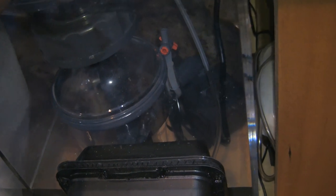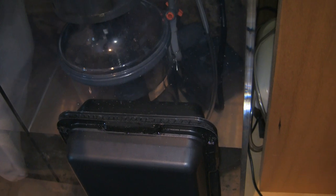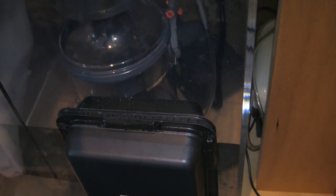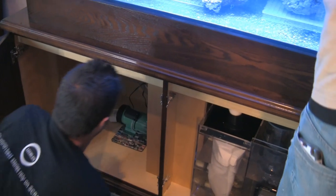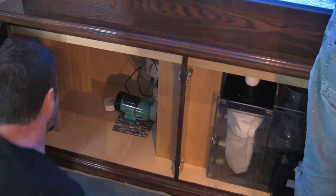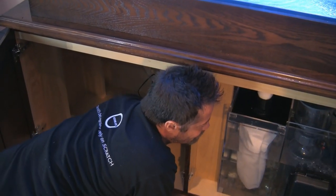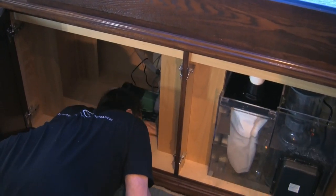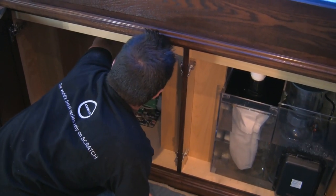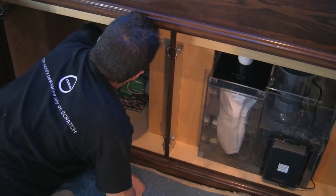Yeah. So, how far up is the water in the skimmer? Oh, it's catching up. There it goes. Your skimmer's not going anywhere now. Shut the water off. Shut the water off. Not primed yet. Unplug it and plug it back in. Oh, that elbow you've got in there is pointing down, so it's got air trapped in the... unplug the pump. Unplug the pump. I did. Now reach in there where that elbow is on that bulkhead.